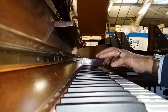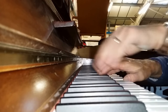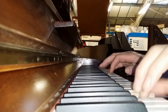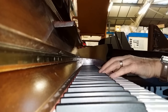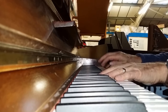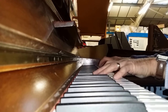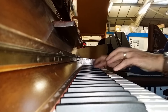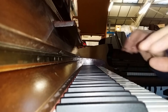Obviously the casework is superb. It has a beautifully rich tone, gained mainly by the damping system being changed and the new hammers. The hammers were terribly hard before and didn't sing at all — they didn't bounce off the strings, and you need the hammer to be bouncy to get a full tone. So that's the restoration of an Ibach upright piano, 1905: was an over-damper, now an under-damper, and such a well-made piano that the conversion is absolutely worth doing. Thank you very much for listening.